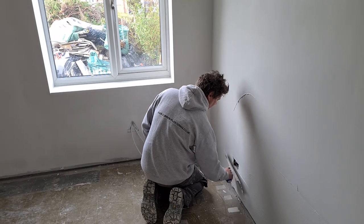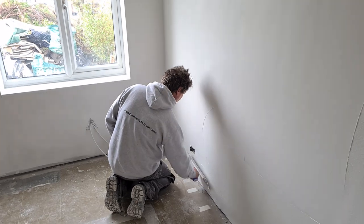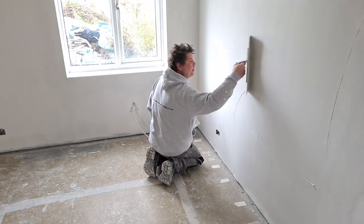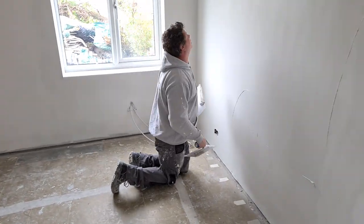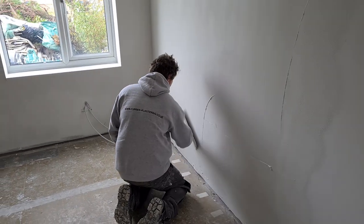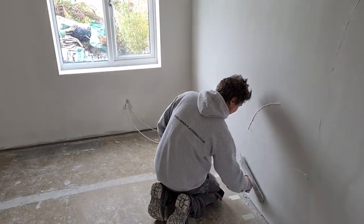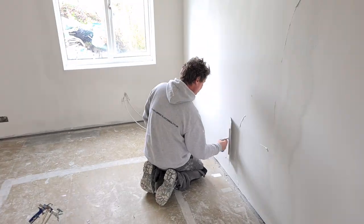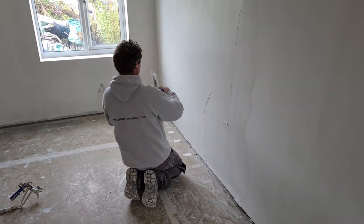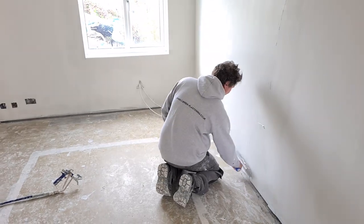Been working with a taper, Ian, recently, showing him how we do things, and he said that actually learning to follow the pattern correctly, to be able to chase a tail and not keep touching the wall in the middle of what you've already flattened, was one of the most important things he's learnt with us. Keep meaning to draw a diagram or something, but it's pretty easy when you watch a video of a whole wall being done to kind of grasp the technique. Obviously, we work left to right because we're right-handed. If you're left-handed, work right to left.